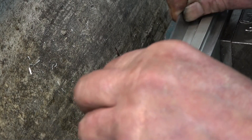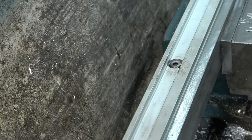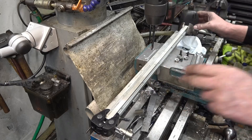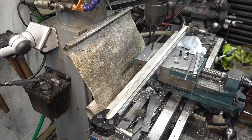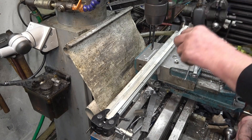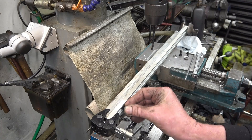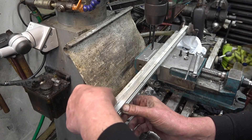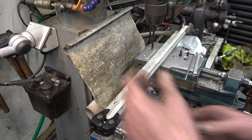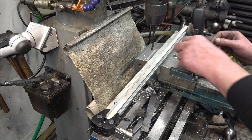Alright, that's fine, that's done. That's spot on, that's enough. There's room to get an Allen key in and tighten them up. Happy with that. I'm going to put a little bit of Loctite on these because once they're in and tight and the magnetic strip is glued on, you obviously can't get to the nuts anymore. Just to make sure they won't come loose.